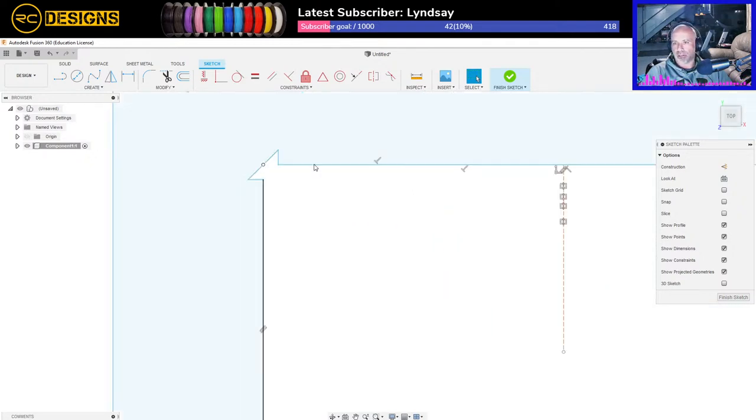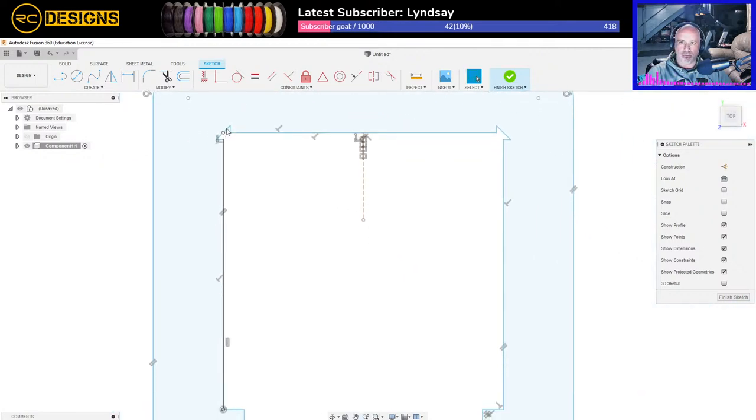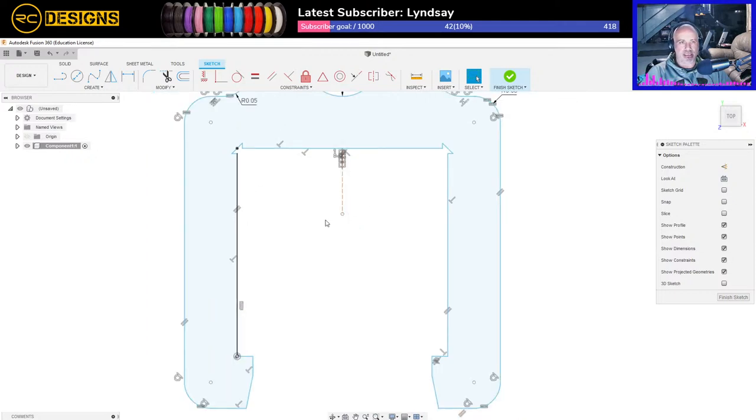Sometimes when you're pushing really small and tolerances are very tight, you technically don't see this per se. I've done a couple designs throughout the house where I needed it to snap so perfect. Putting these little reliefs on there does that. The other reason that I do that is for this tube here. The tube does have a little bit of a radius on it, so I can try and match that radius.